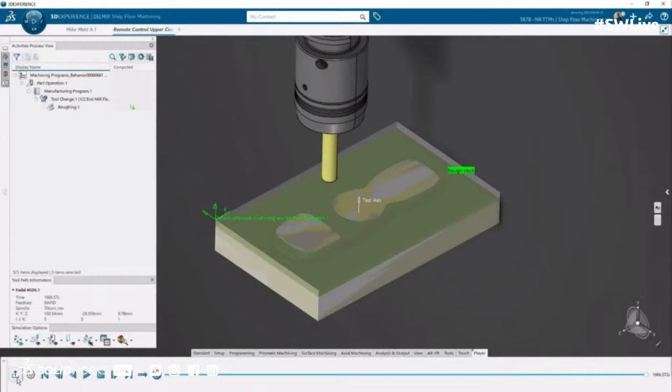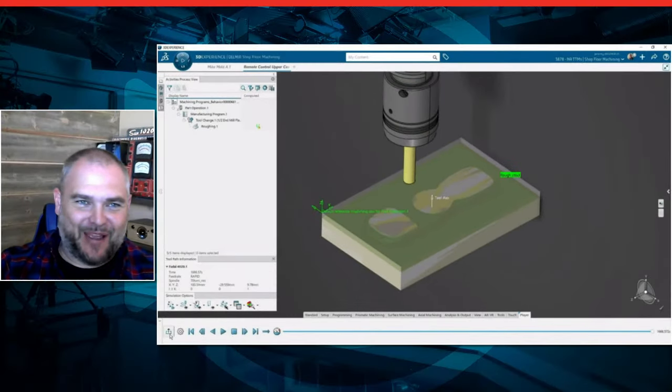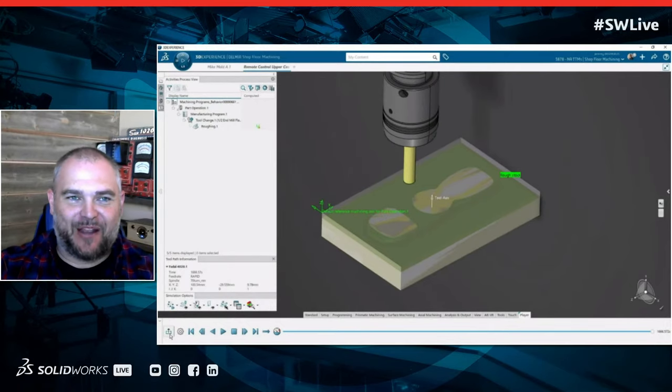Okay. And if I look at this screenshot down in the lower left-hand corner, it's not running right now, but it was spitting out a bunch of numbers. Can you explain, are we actually generating the G-code right on the fly? So we have the ability to generate G-code on the fly. What we're looking at in the lower left-hand corner, because the machine is also tied to this, the actual virtual twin machine, is the cutter location. So we know feeds and speeds, we know location of where it's going to be, we know when it goes to rapid, we know when it goes to feed rate. If you're an old school programmer, or you started in the shop like John and I did, those things are important to us. We want to know as we lead into this what our feed rate is going to be. So we get that real time feedback as we simulate. It's not just a pretty picture on the screen.